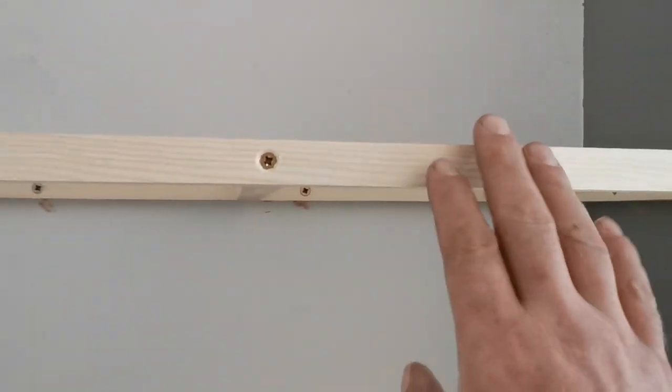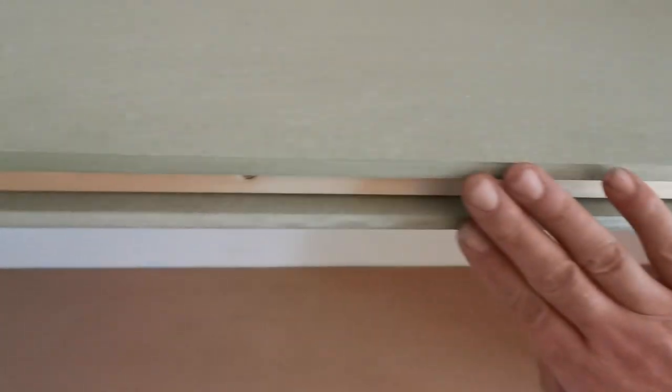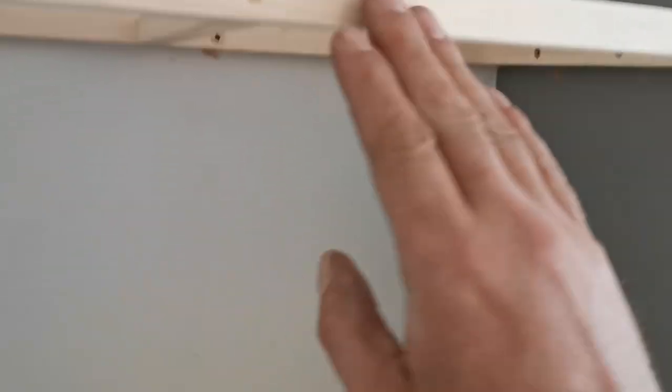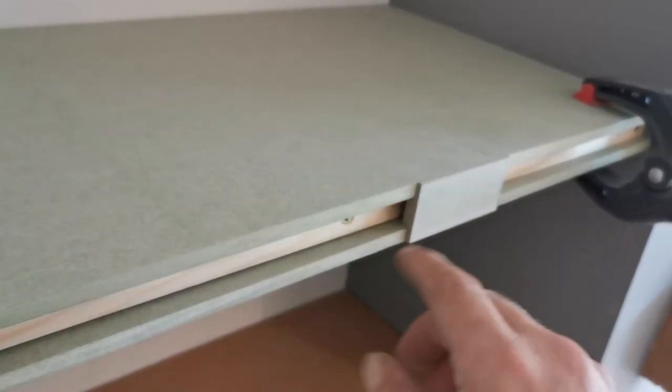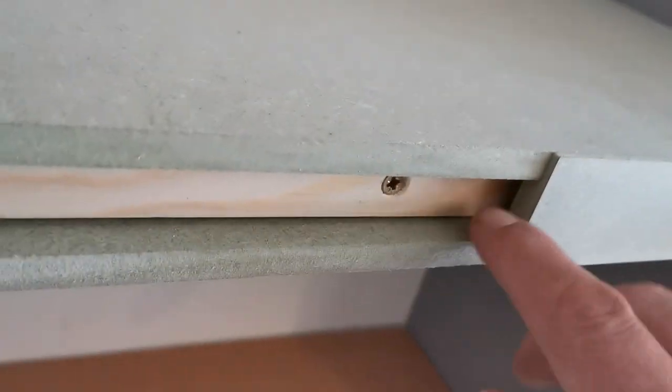It's the next day, Sunday morning. I've just cut these two — I'll film this one so you can see what I did. There's a little gap there but it won't actually move up. I don't mind decorator's caulk on that, and like I say these walls are pretty flush, pretty straight. I'm just cutting the boards to the same width. If they're a little off I'll scribe a bit off the back to pull them in. The back walls are pretty straight so these are pretty straight. It wasn't my intention to get it right back, so plenty of glue on there.